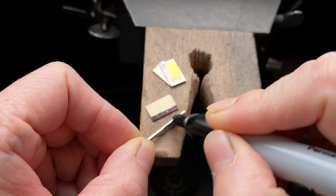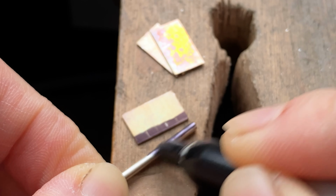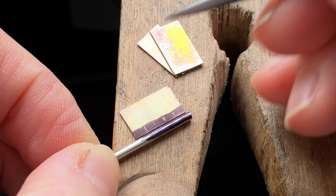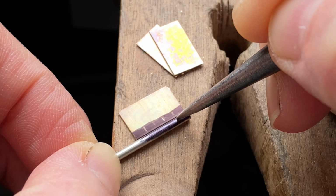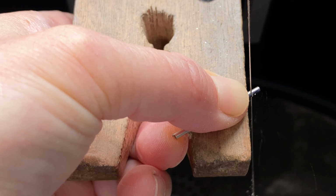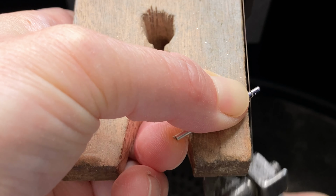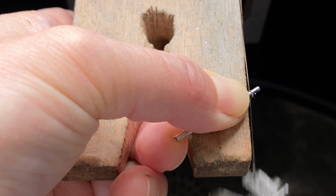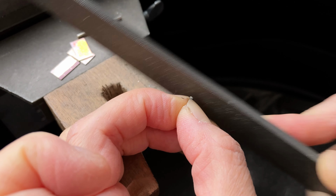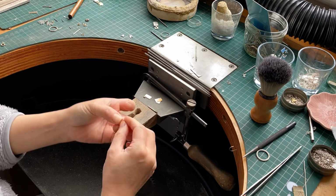Before scratching any mark on my tube, I color it first. Doing that on one side will be fine. Put it next to the silver. Copy the first length onto my tube. When cutting it off, I try to make the edge square. File the section flat. Cut out the other 4 pieces of tube and do the same.